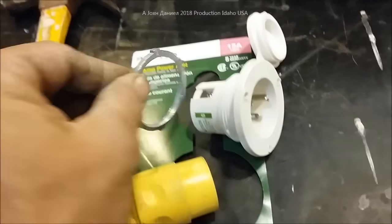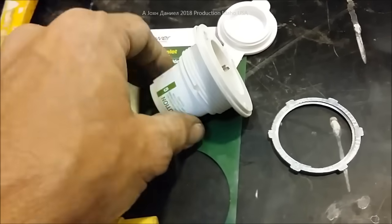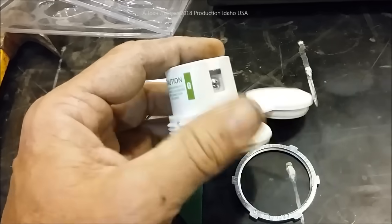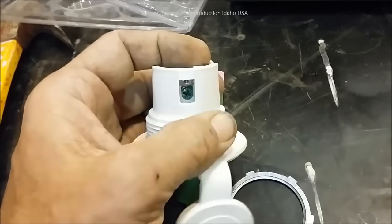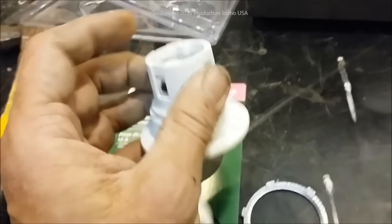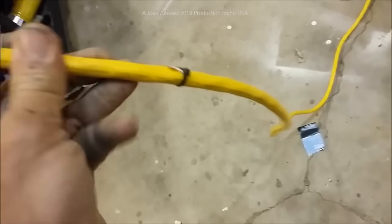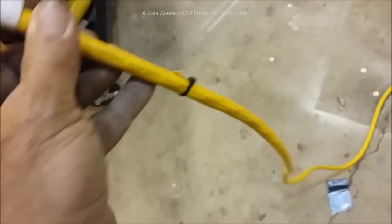This unit comes with a little mounting ring for installing into a metal bulkhead, wall, or car body, and a boot to keep insects and moisture out of your electrical connections. The labeling gives you the definitions: the silver screw is common (neutral/white), green is ground, and black is your hot wire. It'll handle up to 10 gauge wire with a very nice tight fit. The 12-gauge cord is heavy-duty and will be run inside the chase on the back wall of my RV.